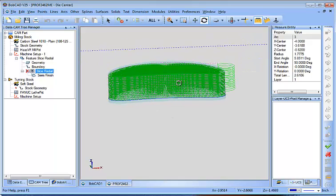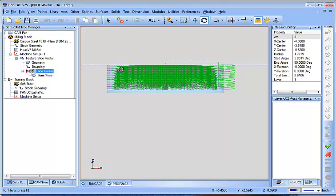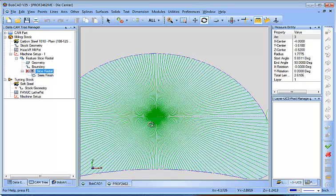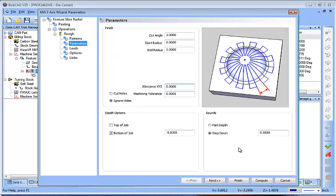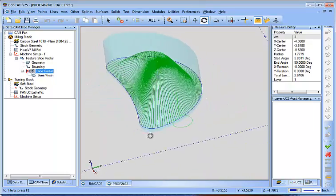What this toolpath does is it's taking the finish pass and slowly stepping it down from zero — morphing it down from zero. So you're getting a lot of movement where the tool is covering areas where it's already covered. You can see here in the center how it's very saturated — the paths are very close together here and further out here, based on the angle of your step over. So I would recommend you just use this as your finish pass because you're happy with the result you get there.